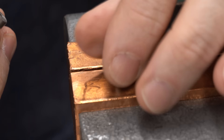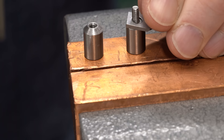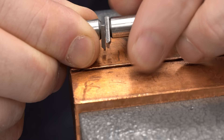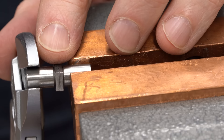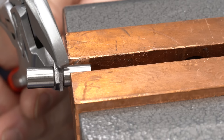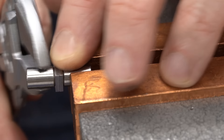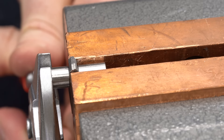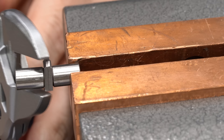There are two of these but I won't make you watch me file both of them. I went ahead and turned up a filing fixture on the lathe — just a piece of silver steel with a chamfer on the end that matches the bevel of the countersink in the parts. I'll put both of them on back to back — just for scale that is an M3 screw. Getting these aligned turned out to be challenging; I found that Knipex parallel jaw pliers do an excellent job of gripping smooth round surfaces without marring them. I used the vise jaws to keep them aligned while tightening, then the parallel jaw pliers to squish the parts into position.